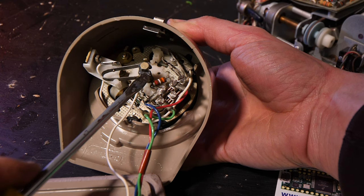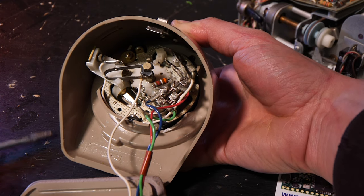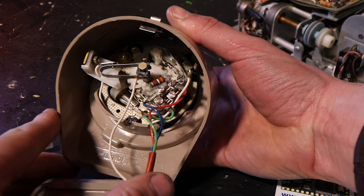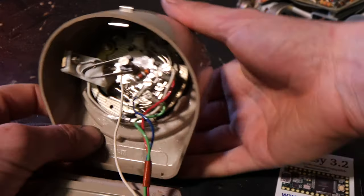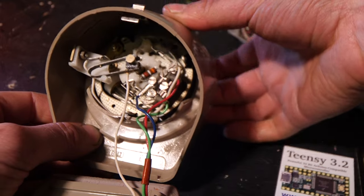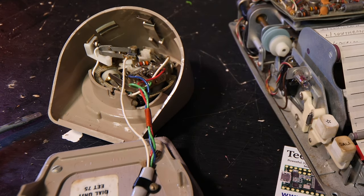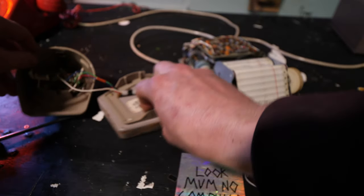I've had to 3D print this part because it snapped when I was adjusting it. It's basically like a slipping washer kind of thing. It's got a slight bit of friction that pulls this bit of metal backwards, but it doesn't affect the actual rotation. So this is an extended screw on the back of the rotary dial. When you wind it and then you let go, the first thing it does is flick this, and this switch apparently tells this when to listen.